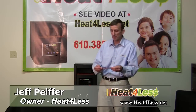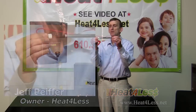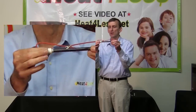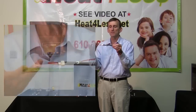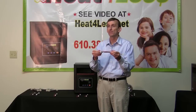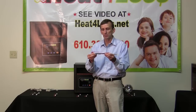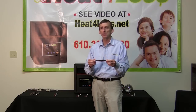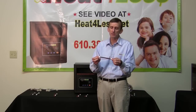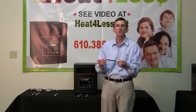The next advancement — this one not only moves a little bit, but it comes out completely. See how the ceramic completely separates from the glass? By doing this, you significantly add to the life expectancy: you're now looking at three to five years as the average life expectancy of this particular model. Most quartz infrared heaters have six of these in them, and this is the design or type of bulb that most infrared heaters use today.